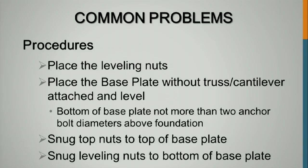It's very important for a lot of these anchor rods. I know we're used to seeing 1.25 inches to 1.5 inches, if not even larger, and that can be very difficult to achieve. So we use slugger wrenches or hydraulic wrenches. And I believe there's a video coming up here. Well, there is a video coming up here that shows what we use.